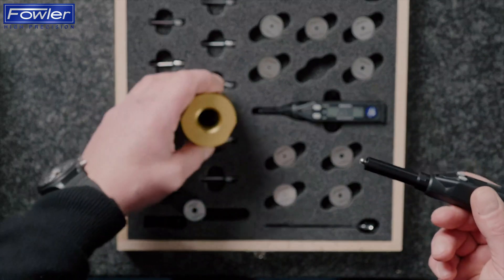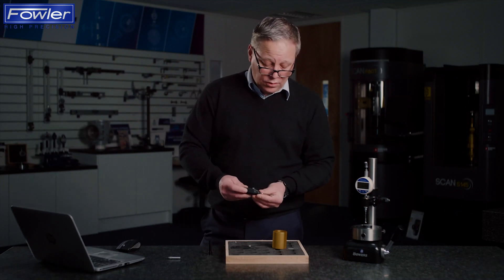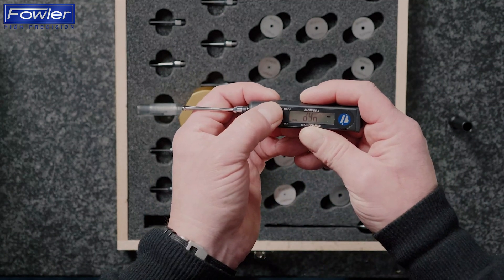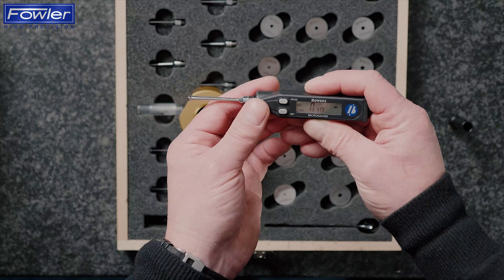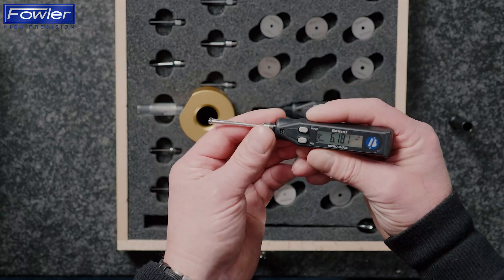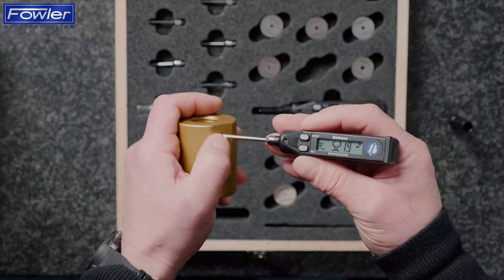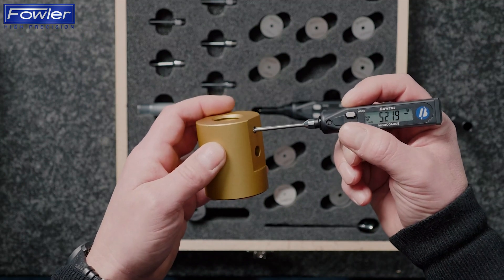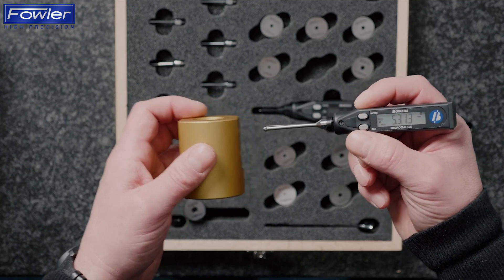However, if the bore has been machined from an angled face or from a diameter, then we're going to need to use the diameter mode within the gauge itself. If you hold mode down, we can see we've gone into dynamic mode, and if I scroll through the options I can come to diameter. I'm going to select diameter — what that does is tells the gauge that you want to freeze the display at the smallest value as you roll through the diameter. I'm going to enter the probe head into the bore, reset the gauge, sweep through — there is my diameter.